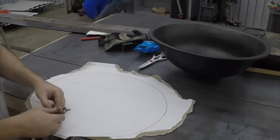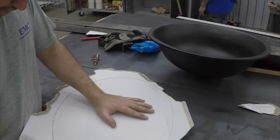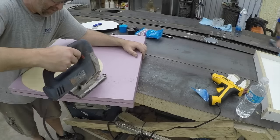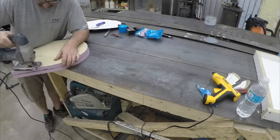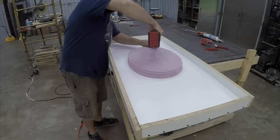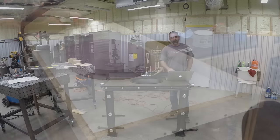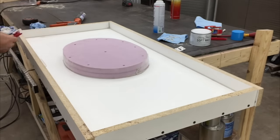Even though it's dropped in right now, I've got bolts in it from the underside to bolt it in — I just haven't bolted it in there yet. I went ahead and cut this out of cardboard, then measured the outer edge. Because it's undermount, the hole needed to be closed in some, so I used some scribes to get the inner edge so I would cut in the right place. I used two pieces of foam stacked together — that was the only thickness I could find — then cut that out, glued and screwed it down to the melamine with hot glue, and put some screws into it as well. Then I went around checking with the sink to make sure it was still the right dimension. After that, I used some silicone to seal up the joints and scraped off the excess with those rounding tools you can get at Home Depot or Lowe's.